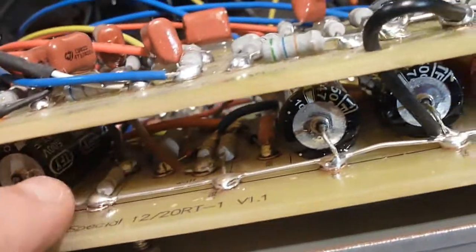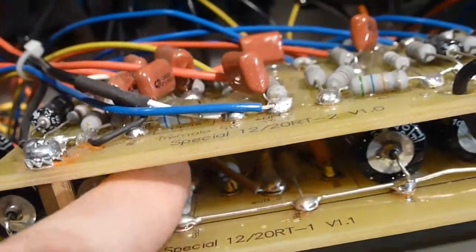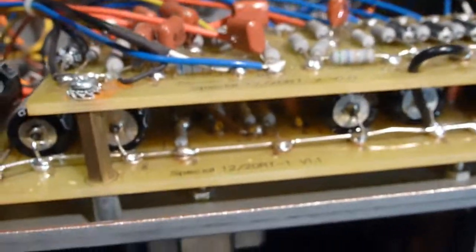There's a diode, I believe it's this one over here. Yeah, there's a diode between that circuit, I think a protection from backflow between there and the rest. So I should be able to run that light bulb in between just to test out.